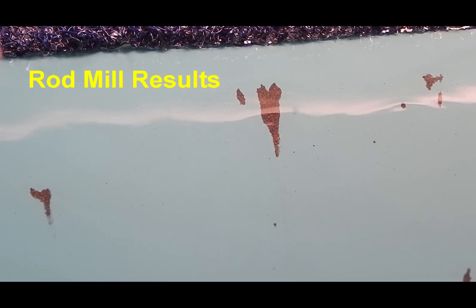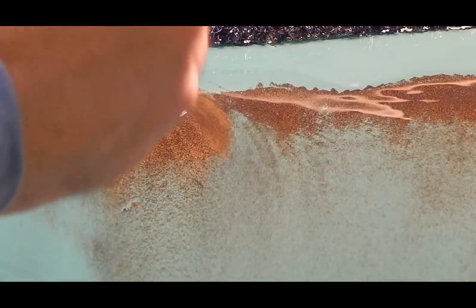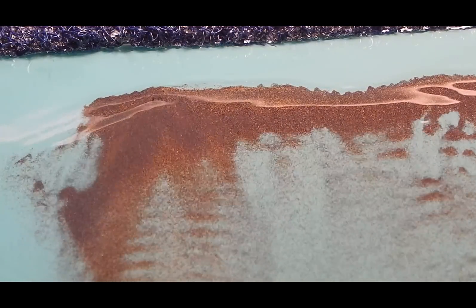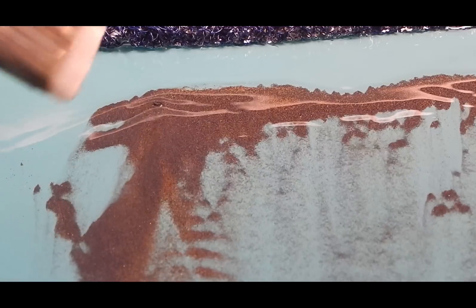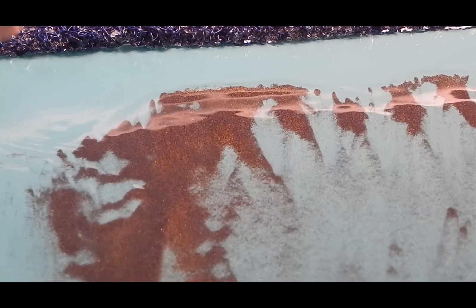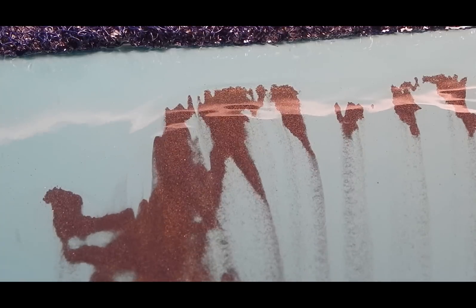Now this is the rod mill sample. One thing you may not be able to tell from watching, but when I put a new spoonful of material on here, watch how fast this cleans off. The big difference I can see between this and the acid is that for the same material, this stuff has been refined or beat down to a smaller size — the sand in here is very, very fine. It processes down the table very quickly compared to what the acid did. The acid didn't change the size of the material much, but running it through the rod mill knocked down the crystalline structure. The gold didn't change because gold is malleable — it just got beat up a little bit. There's a little bit of fine gold in there, but not much. When I get done running all this sample, I'll come back and show you how much gold I got.